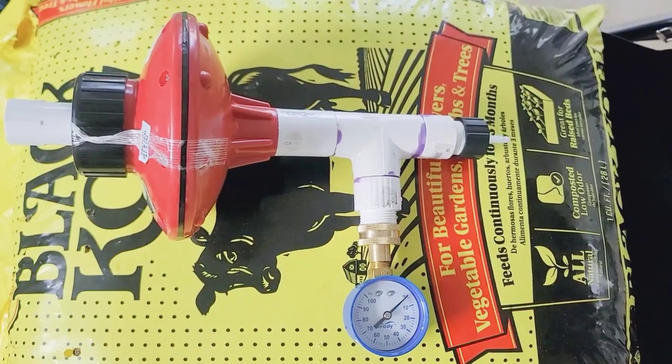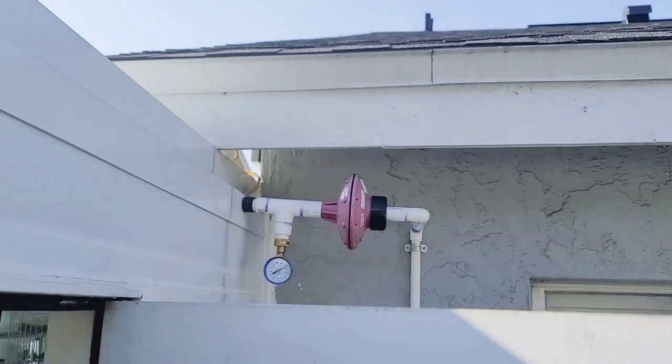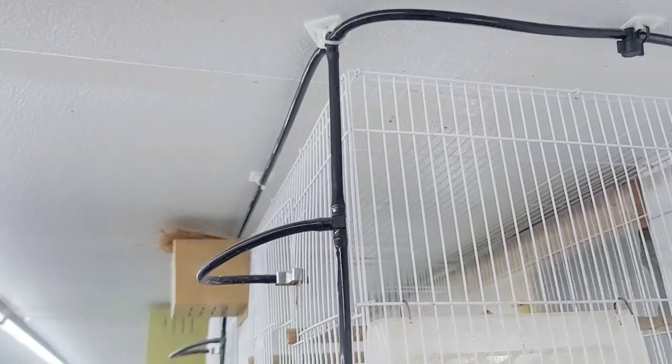This pressure reducer converts city water coming in at probably over 50 PSI and drops it all the way down to about 3 PSI. You need this — you cannot connect these lines directly to city water at anything over 10 PSI because that's just too much pressure for this system. What will happen is it could blow out the valves, the valves could leak, you could start having problems with your T's leaking and so on. So you need to buy a pressure reducer to get the pressure down enough for these valves to work properly. Once you set up the pressure reducer, it comes in half inch directly from the hose, passes the filters, comes up to the pressure reducer, and from there it goes straight to the normal hose that feeds into the inside of the aviary.